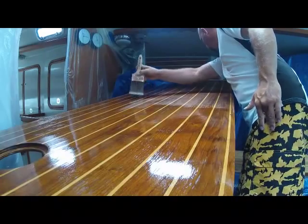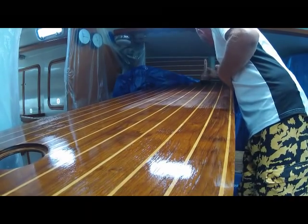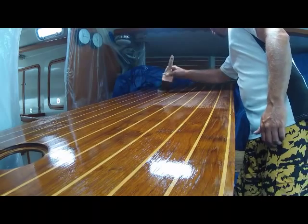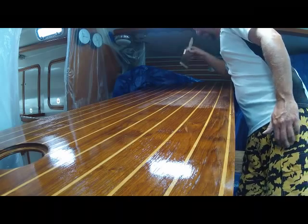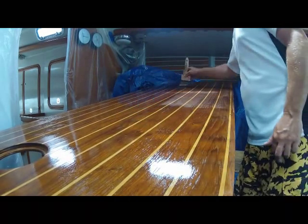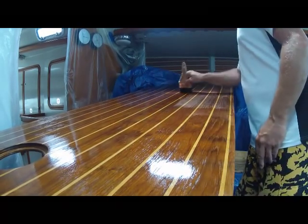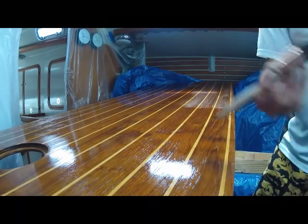From there I'm going to use a mixture of 25% varnish to 75% mineral spirits. I'm using the 25% varnish ratio because I need it to soak into the grain of the wood rather than sit on top — using straight varnish wouldn't have a good bond to the actual board. I'm using clear varnish to start, and this will actually be finished with a satin or rubbed finish look. Use the longest strokes you can while ensuring you're getting all of the board and not leaving out any spots. Look at different angles to check coverage, get the edges, and watch out for runs — always go back over the edges where the brush can squeegee varnish out. Don't use an excessive amount of varnish, but coat the board well.